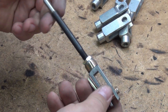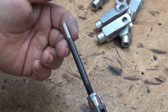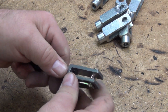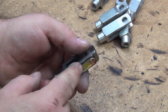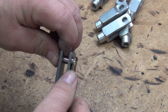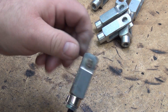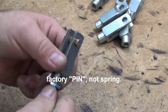Add a jam nut, put the two together — the rod that I've shown before — and put the clip in it, and there you go. Part of the reason for the narrowing is that it fits the factory pin, but it also leaves a little bit of a gap here so you can hook the return spring into here if you want. That was part of the motivation too, but primarily to fit the factory pin in case people don't want to use the included one.